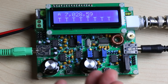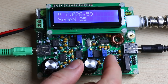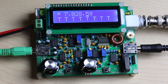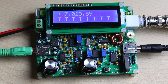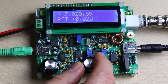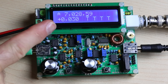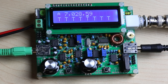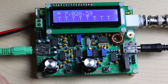When the radio first comes up, it defaults to whatever settings you've configured. If you want to change the CW key speed, just press this left button and use the encoder to change whatever speed you want, then press the exit button to get back to the radio. If you double-click this left button — a single click gets you Morse code speed — double-click will get you the RIT function. You can set whatever offset you want, then press the left button to confirm. If you double-click again and then hit the right button to exit, it'll zero out the RIT.